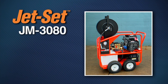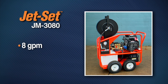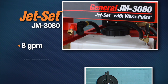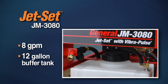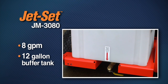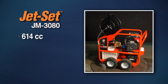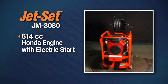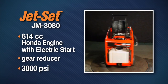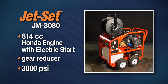The JM3080 gives you the increased cleaning power of 8 gallons per minute without risking pump damage if your water supply can't match the demand. A 12-gallon buffer tank gives you the added safety margin you need when using a high-flow water jet to clear larger and more difficult lines. A 614cc Honda engine with electric start and 2-to-1 gear reducer drives a 3,000 psi, 8-gallon per minute pump with VibraPulse.